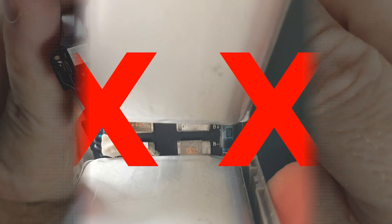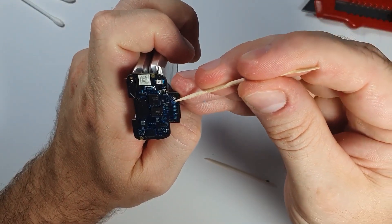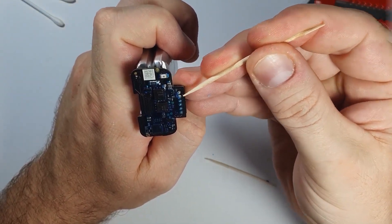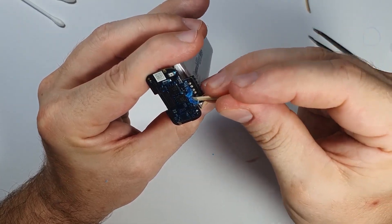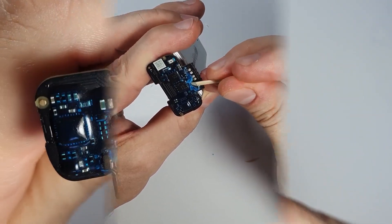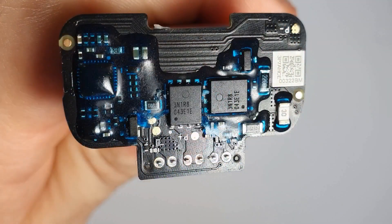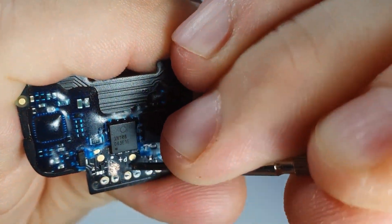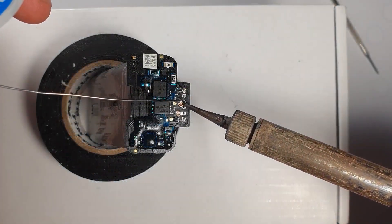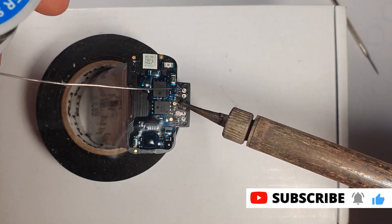Please do not solder on the battery terminals where the original cells are — it will not work and you can potentially destroy your battery. This plastic epoxy glue needs to be removed from the PCB to be able to solder on it. You don't need to remove as much as I do — I just want a better solder location on the positive and the negative. It is enough to solder on the pins, but be careful not to short the battery. I'm removing the silkscreen here so I can actually solder on those pins — this is the trickiest part of the whole thing.